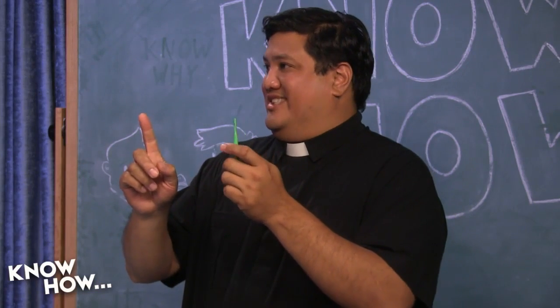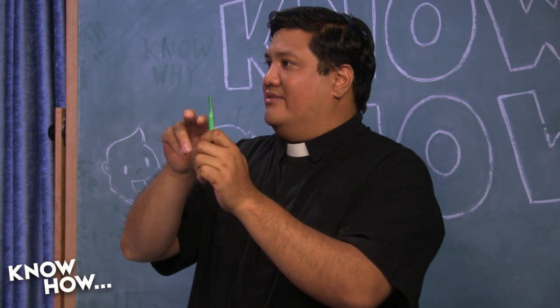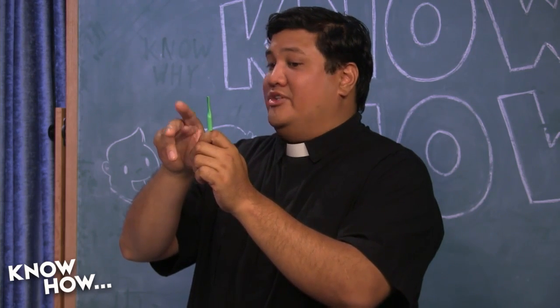You can get electrolysis. You've got two wires, one ground and one positive, and they'll start separating water, H2O, into hydrogen and oxygen. You'll see little bubbles come off. That's also not good, so don't stick your hand in there if you see that. No, it's not going to hurt you, but what's happening is your wires are corroding. Oh, yeah, that's bad.